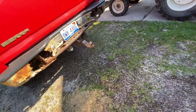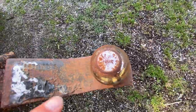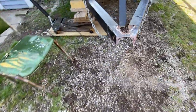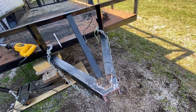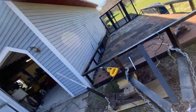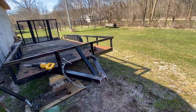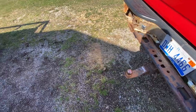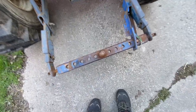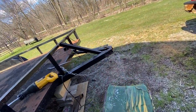I believe this is two-inch. Look at that bumper, needs to be replaced. Yeah, right there it says two-inch. So I'll replace that with an inch and seven-eighths. For as little as I use this, I know it only takes one time for it to fail and you're going to be sorry, but inch and seven-eighths is going to be plenty big enough — it's only one-eighth of an inch shy. Everything's going to be inch and seven-eighths; it doesn't have to be two-inch.